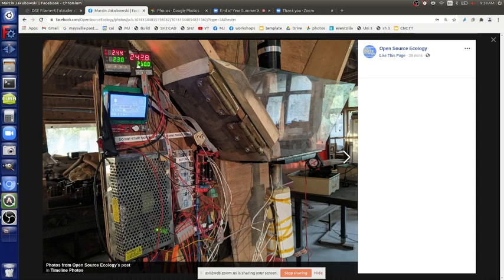Yeah. So right there what we're seeing is that with a set point of 230, we're reading at this specific moment in time 240, the other one is set at 230, and it's reading 244. That's actually close. No, but this is a snapshot. It didn't really stabilize. It doesn't reflect what is true, because we can't see the temporal evolution of this.